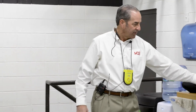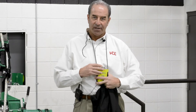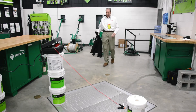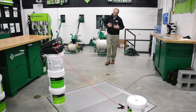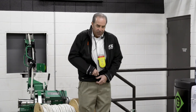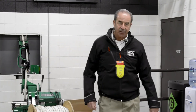One of the questions asked a lot about the V-Watch: is it rainproof, is it waterproof? We consider the device to be rainproof. If guys are wearing a jacket in the rain, should they keep the device underneath or outside the jacket? Demonstration shows you still get audible and visual alerts under a jacket, though you can't hear or see them as well. The cloth itself is not blocking the electric field, but in any bad conditions — rain, snow, sleet — our position is to always keep it outside the jacket.